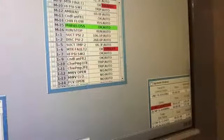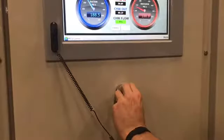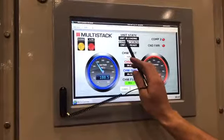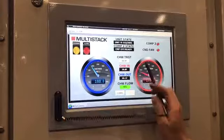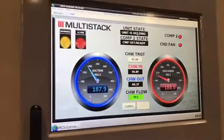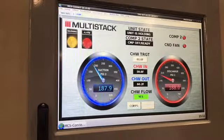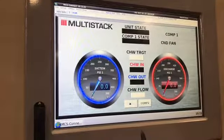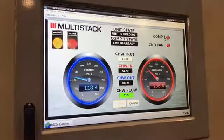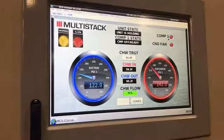The main lesson there: it seemed that you could hit reset lockouts and it wouldn't necessarily tell you that you don't have a maintenance code — it just wouldn't reset the lockouts, but I may not understand this perfectly well. With having reset the lockouts and corrected the high pressure switch, the unit was loading and now the unit is holding. I'm not 100% sure I understand what holding means. I'd like to see a definition of the different things on this screen, ideally with some screenshots, similar to what's in the Operator's Guide for the older controller — just using the newer controller and giving a tour would be pretty handy.